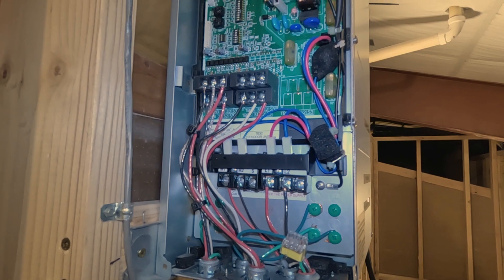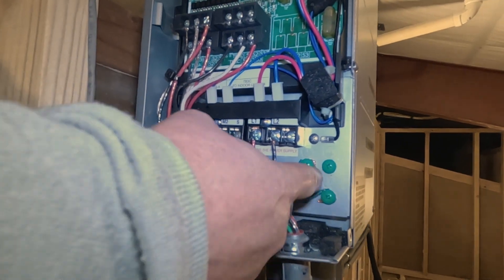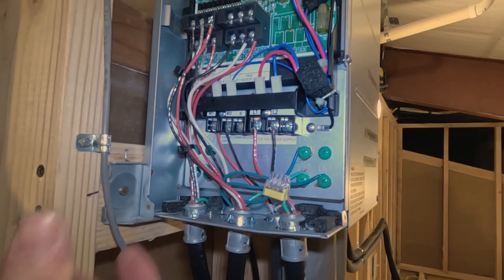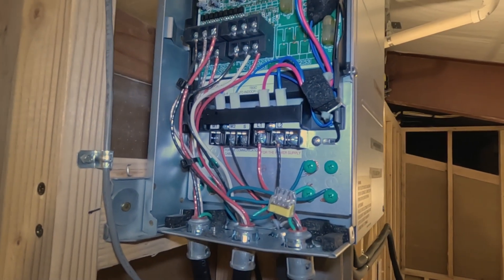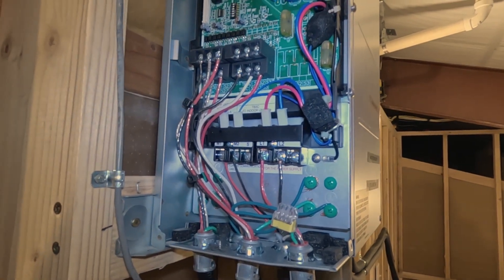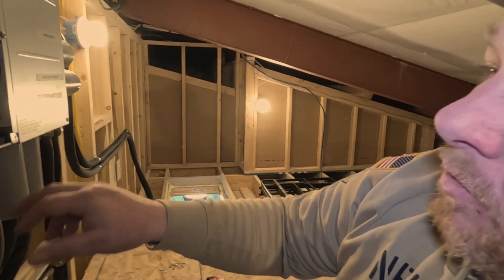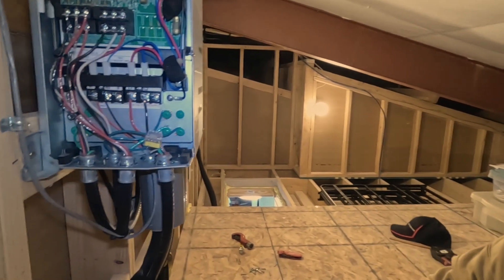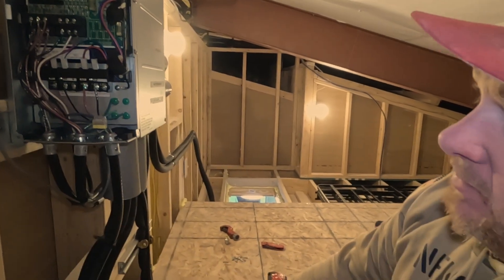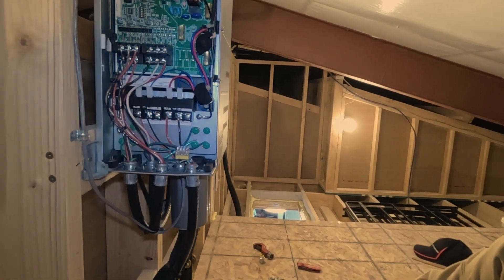At the condenser outside there's a corresponding terminal and we landed the shield wire on the S terminal. You only do one side or you'll create an antenna, so just do one side — you can do it inside here or out there, it doesn't matter. We ran the power feed from outside, so it's grounded out there, and we brought the continuation of the ground into here. The 16 gauge shielded communication wire is all isolated, grounded outside and not inside, so no antenna effect. This branch box is ready to go back together.